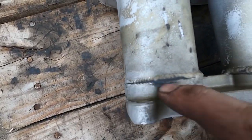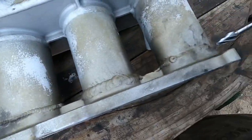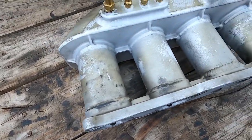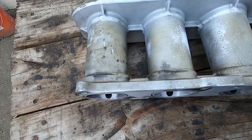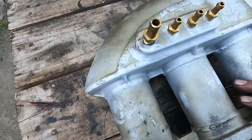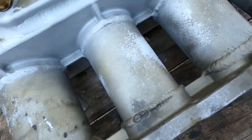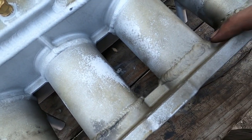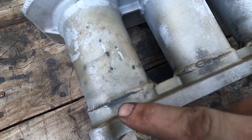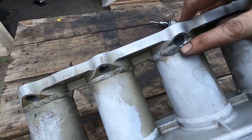You can really see where it's cracked there. It's cracked almost all the way around on both sides. What I'm going to do is take the die grinder and chop all this weld off to get the manifold flange off so we can get it really clean, because you can see how much oil and stuff is in there. I can see where somebody's repaired it once before - you can see how big and spread out that weld is, and then these tiny little ones are all cracked.